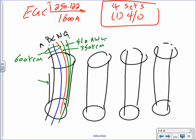If I ask you about the conduit, guys, this is in a PVC. I'm assuming it's going to be a PVC Schedule 80, because we're using it in a highly corrosive environment. So on the test, sizing the neutral is a must. The ungrounded conductor is a must. The equipment grounding conductor is a must. The conduit is up to you.